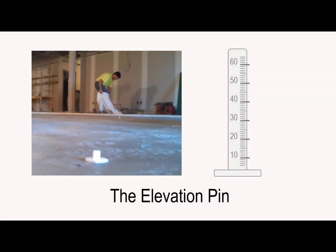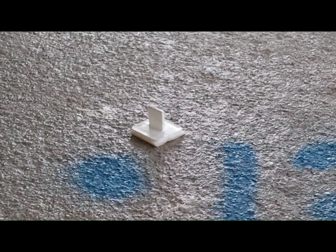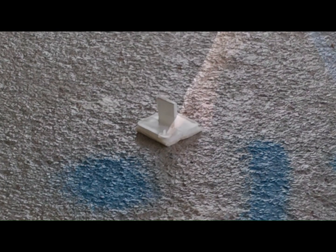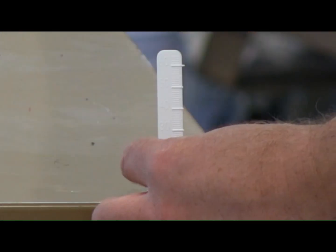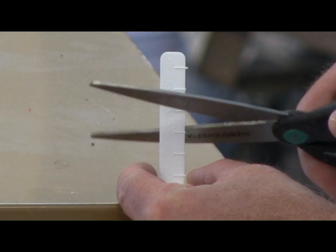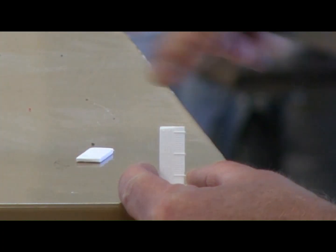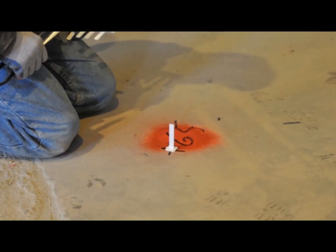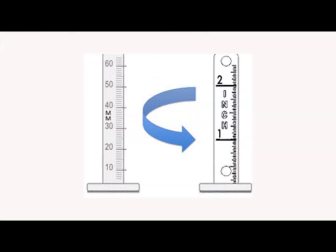The elevation pins. An elevation pin is a plastic pin that's cut and affixed to a substrate in order to provide a visual indicator of the required finished floor height during a pour. It improves the quality and speed of poured flooring applications. It's used with the NIVComp Digital Level or any other leveling device. Its industrial adhesive foot sticks to all substrates. Its high-quality rubberized polymer construction springs back when kicked or stepped on. It has a millimeter scale on one side and inches on the other.